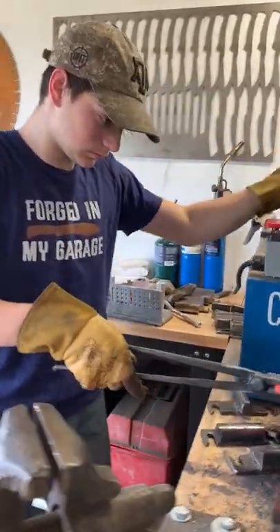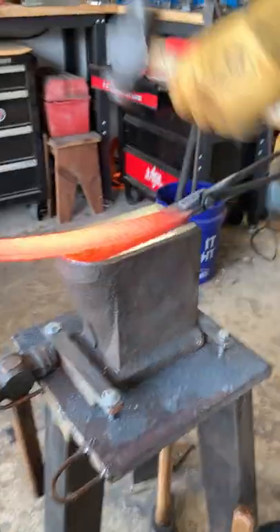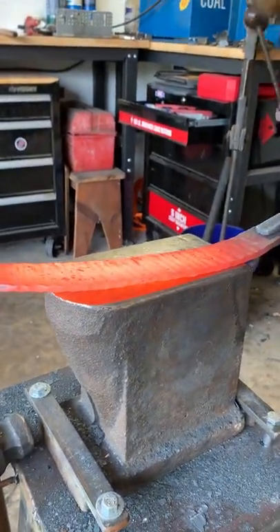I just put on the press. I did two heats just to give it some more length, but now I'm just hammering out. I'm about to do the bevels. Actually, I'm going to do the handle first and then the tip and then the bevels. I think the last forge I'm going to do is putting in the bevel by hand and then giving it a nice downward curve — give it that shape that I want, and onto the grinder.